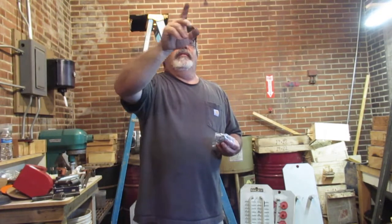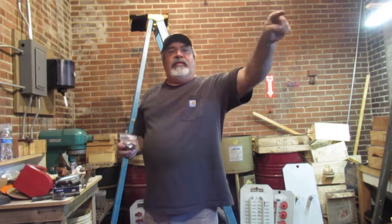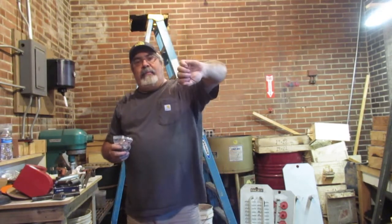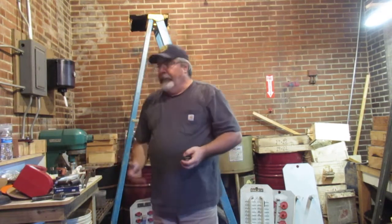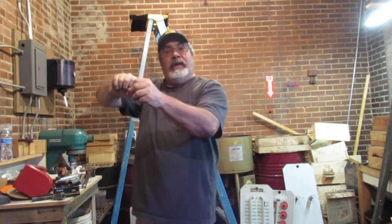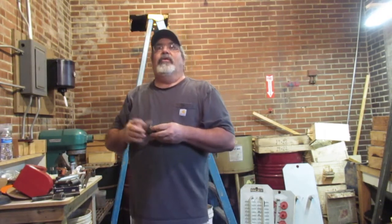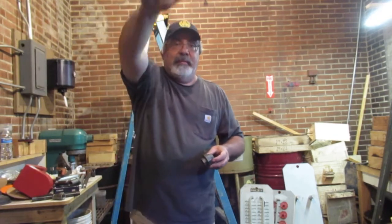What we're doing is all in a straight line. You can start over here, add a piece, add a piece, add a piece. There are times where if you do that and you need to do something in the middle, it's impossible to take a piece of pipe out in between two joints. So you're just going to have to take it apart piece by piece by piece.